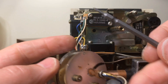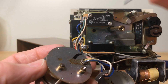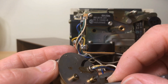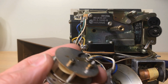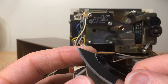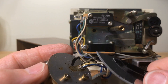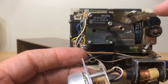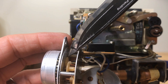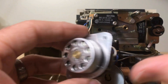To do that I've got to undo these rivets. If this was made to be serviced those would be screws, but I'm going to show you how to do that and it actually can come apart relatively easily. I'll use my handy dandy knife here and scrape those off - scrape the swelling off. It's not really a rivet but it's been pressed and expanded. So you can scrape that off and then pop that plate off - there's that gear, so we can get to it and replace it.